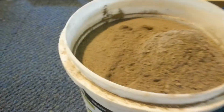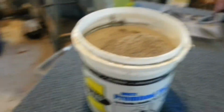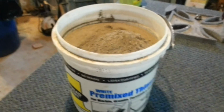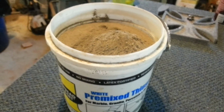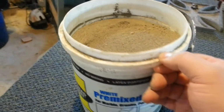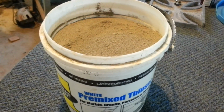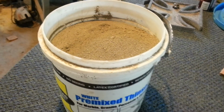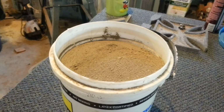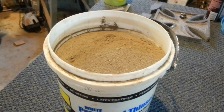So this shortened our time down greatly. I guess I spent probably an hour and a half or so doing that yesterday, and ended up with this one gallon pail of powdered bentonite clay. I guess it's bentonite, it's clay anyway. So we will mix that 10% by volume with play sand, which is super fine, and that'll give us our green sand. So there we go. Easy peasy.